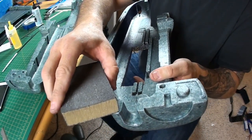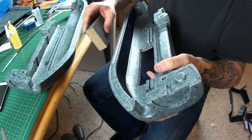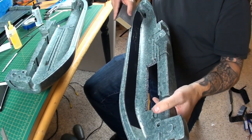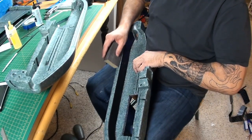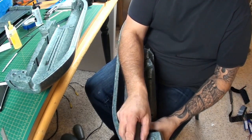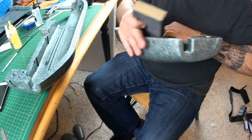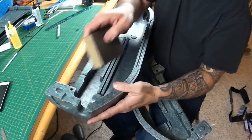Another good idea is to scuff up the inside anyhow, so that when you put your glue on, it'll adhere. That one groove that's on the outside, you don't want to do, because that's going to go to the other side, and it'll actually help mate the two together. You see me just running my block very lightly. I think that's probably a 200 grit, maybe a 150 grit sand block. I'm going to do that on both sides.